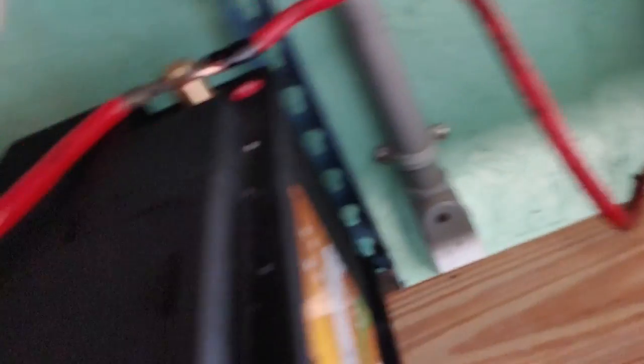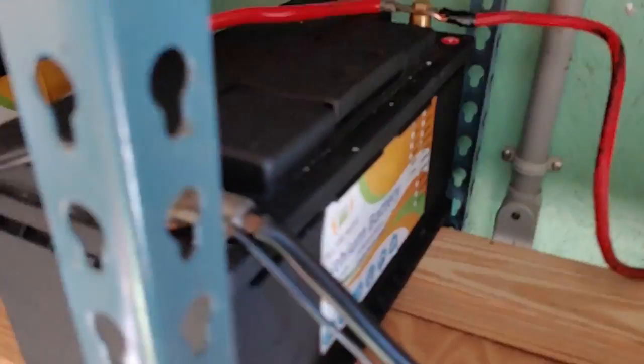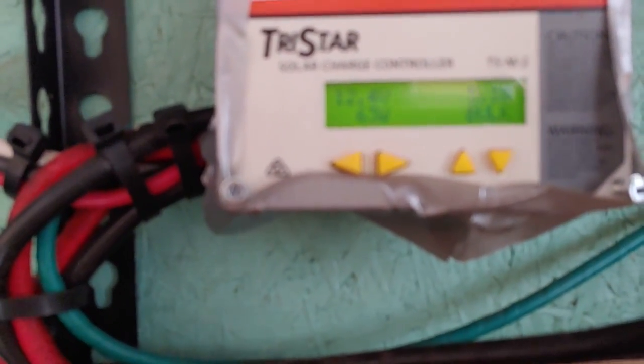Nothing seems to be hot, which is important, because the cable came off and I'm not sure why. If they do get hot then we need to know for how long and whether we need to get stronger cables. Now this charge controller says it's still in the red — we're taking out more than we're putting in — but that's part of the test: can the lithium batteries stand up to running the well pump? Right there, 12.4 volts and 5.5 amps — it just went up an amp.